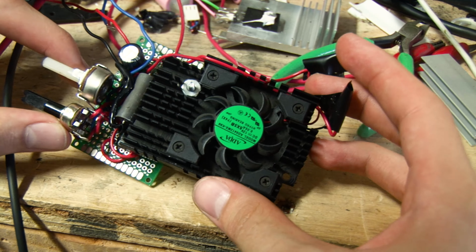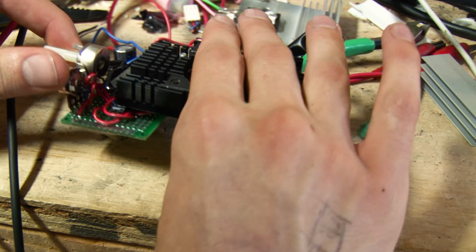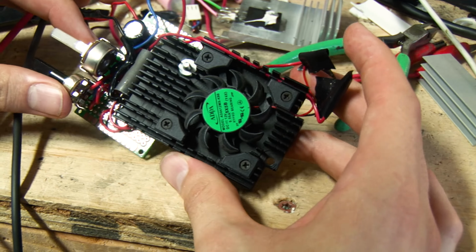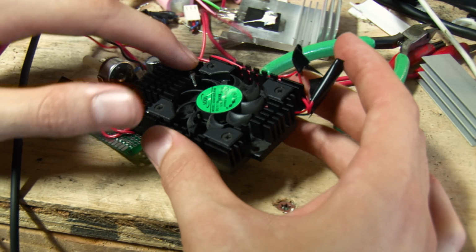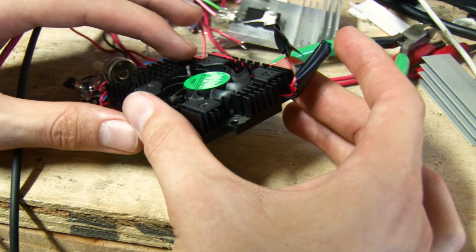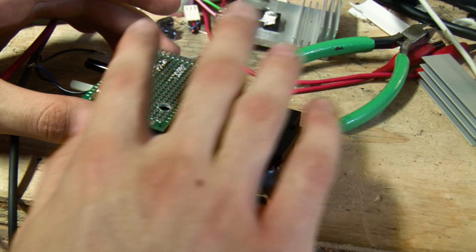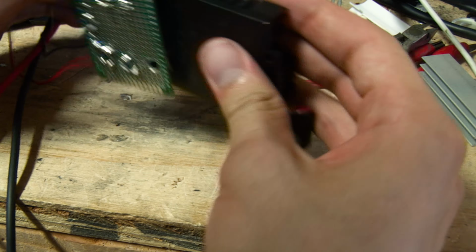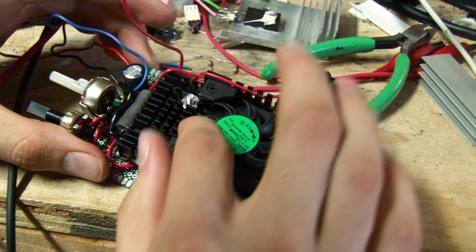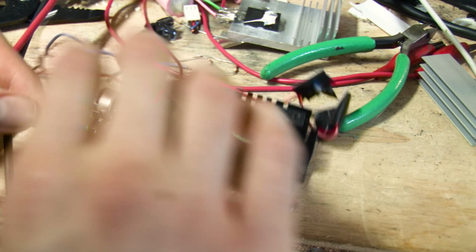So I just finished building this whole thing, and there was a little bit of annoyance, but it actually worked pretty well. The big thing you see here is this heatsink, and it's mainly held on to the TO220 MOSFET here with this little screw. It holds surprisingly well. I put some thermal paste in it because I want this MOSFET to stay as cool as it can. The fan's wired in here and runs at full speed. Basically, just don't put more than 12 amps in it.